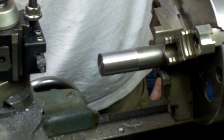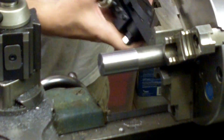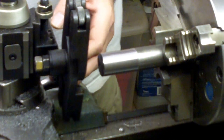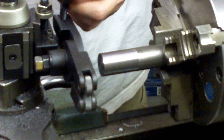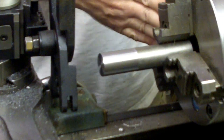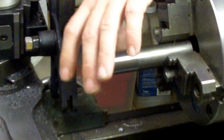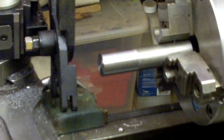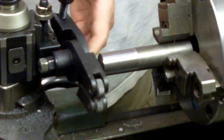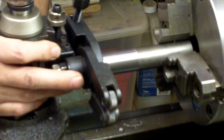So now we're ready to set up — this method would be the same for each tool type. We're going to put on the knurling tool. We want it perfectly perpendicular to the part. There are two ways to do that: if you have enough travel, you can roll it back and find a flat spot on the front face of your chuck and line it up that way. If I'm doing something this large, I use the end of the work. So I'm just going to loosen this up and wheel it in here and get it pretty close.